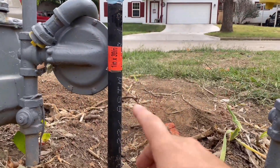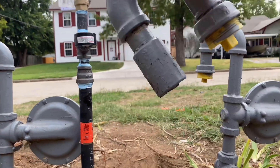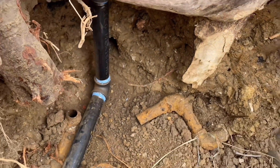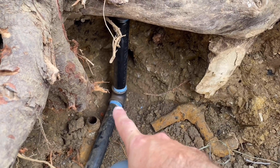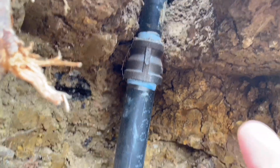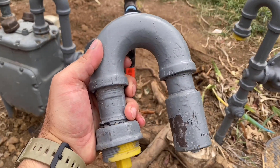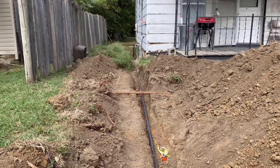Just get your pipe set up through here and the city piece would go on there - now we're back in action and ready to call for them to put that in. I'm going to make a whole other video on how to air it up and test it before you bury your lines, which I'm working on. I'm going to do a 24 to 48 hour test so I'll be back with you on that. Under here it reduces from one and one quarter to one inch and goes through the old hole, comes up through the old hole, and then you'd put the city piece on top after checking it. If this video is helpful, go ahead and like it and subscribe to my channel.